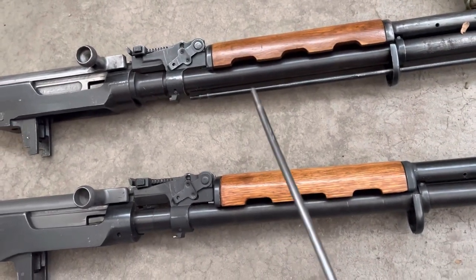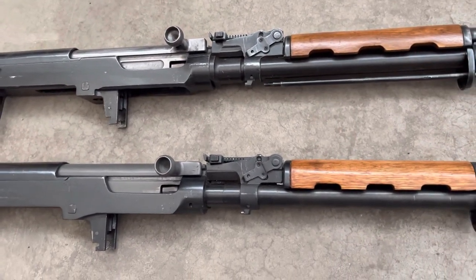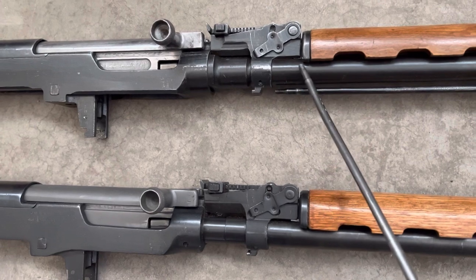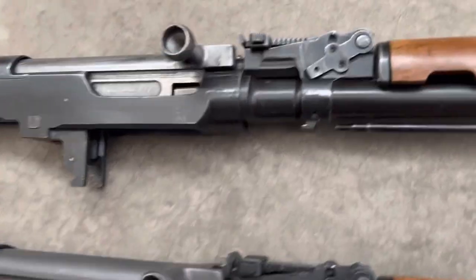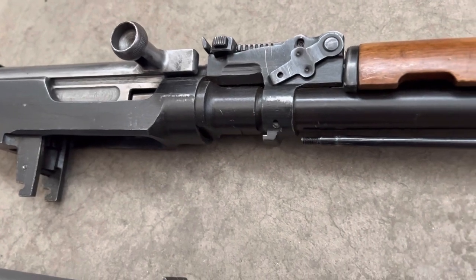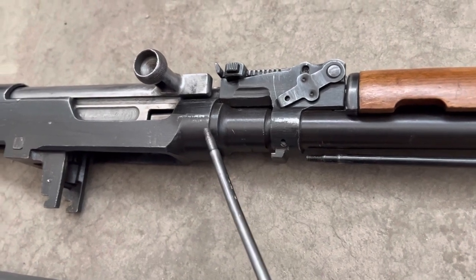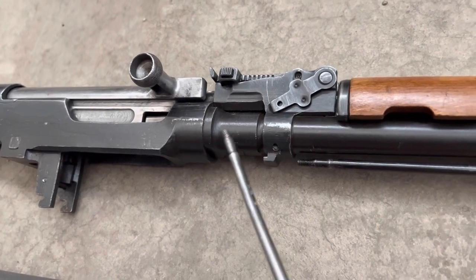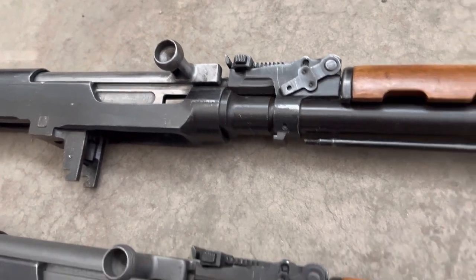Obviously, these are the barrels. And these are the receivers. They're separate components, but they have to attach. So how do they attach? Well, in the case of a threaded barrel, this barrel passes through the rear sight assembly. And if we look really closely in there, we can actually see right about here that last little bit of thread where that barrel is threaded and it's being turned into this lug, which is attached to the receiver. And that's how you're ultimately going to get that interface, set headspace, and do all the other important things that you need to do, by turning that barrel into the receiver.